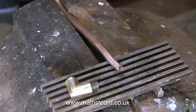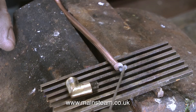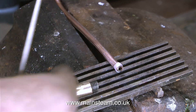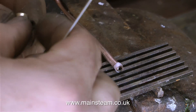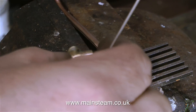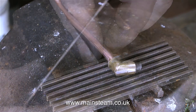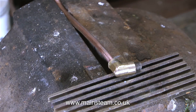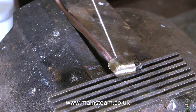Normally I would do both ends of a piece of pipe in one go, but for the purposes of the video I'm going to split it. If you're getting silver solder flux down the pipe, blow down the end of the pipe to get rid of it. The silver solder flux needs to be just around the outside edge of the pipe, because generally speaking the silver solder will try and flow wherever it sees the flux. The piece of stainless steel fire grate I use is very useful for propping things up in the right position when silver soldering in the vise. These components are going to be heated to red heat shortly, so it's most important that they are firmly positioned before the soldering process begins. I'm also applying a little bit more flux to the end of the brass fitting.